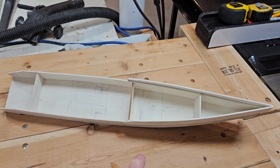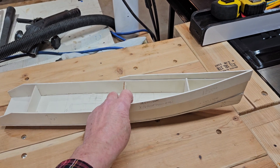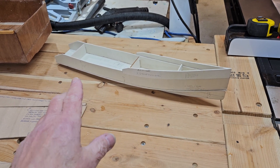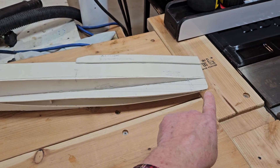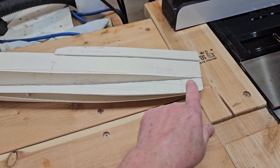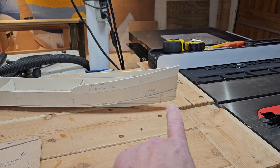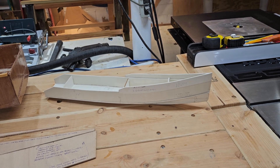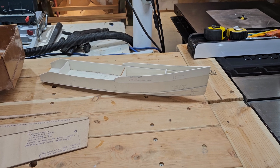The Idaho design is basically five feet wide and 31 feet long — very much longer and narrower than your typical outboard motorboat. The benefit of that is it's much more efficient at lower speeds, and also at high speeds. You've got a very flat aft section so it planes relatively easily. The Idaho design is basically just a flat bottom the whole way, with about a four-inch curve up at the bow. It's a very slight curve and the rest is flat, which makes it super easy to build — a bunch of plywood, some epoxy, and a bit of fiberglass.